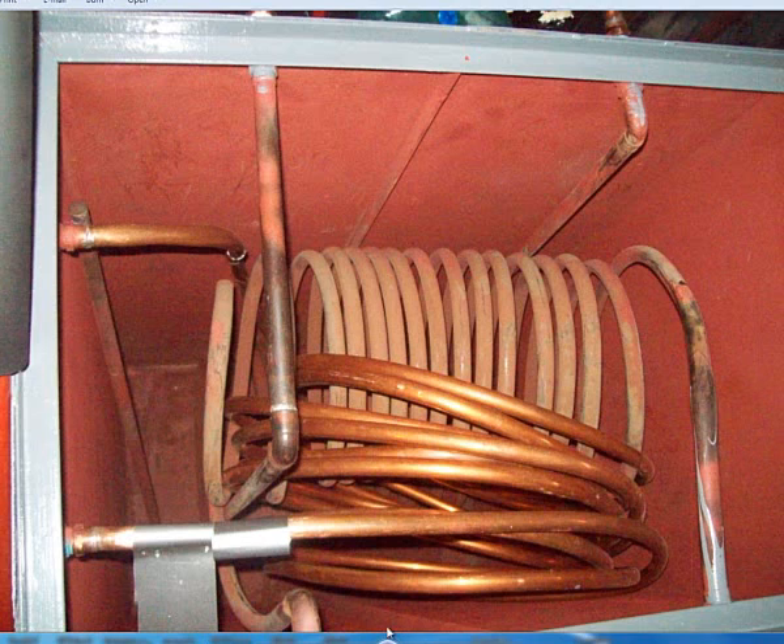If we look a little bit deeper, you can kind of see how the layout is. This is a relatively expensive system because there's an awful lot of copper in there, but it's been rebuilt. One downside is that these tanks tend to rust out a little bit faster because they are exposed to air. But the good news about this open vented system is that being open, it gives you time to maintain the system and redo it to keep it from falling apart. This tank right here is about 35 years old — it was in great shape, it was rebuilt, there are no leaks, and it's a fully maintained system.